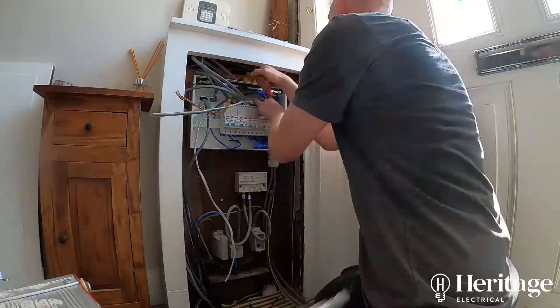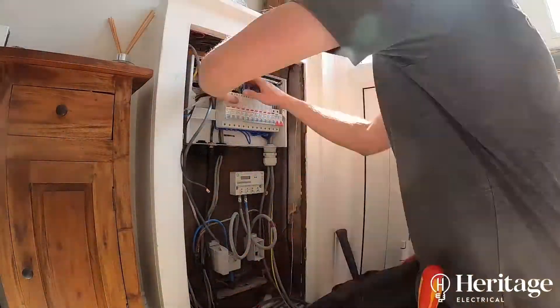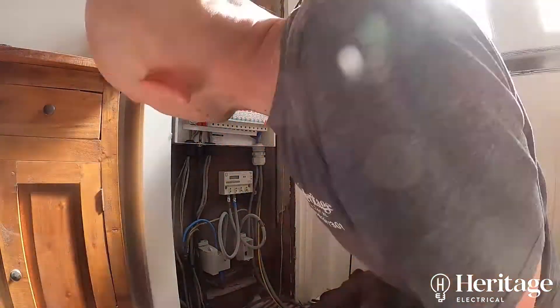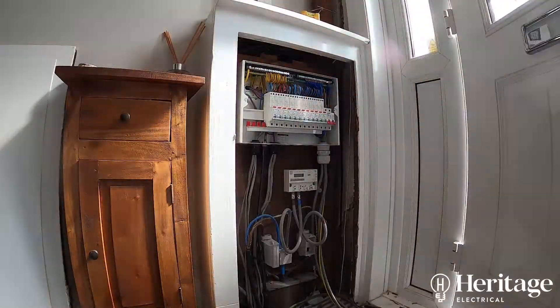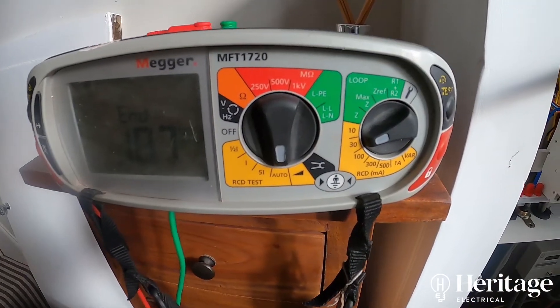So let's look at a quick bit of testing — we'll do some RCD tests. You'll notice here that we've got four spare ways in the board. Once the busbar was screwed into place, those Hager blanks don't fit, but you can see that you're provided with little plastic caps which go on empty slots in the busbar. We're just going to use the provided blanks to cover up those spare ways and ensure that the customer can't get their hands on the busbar and live connections.